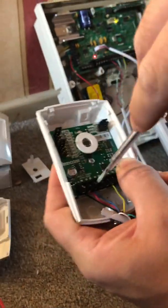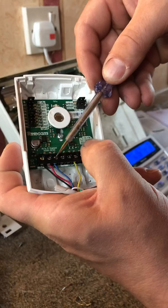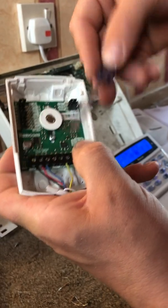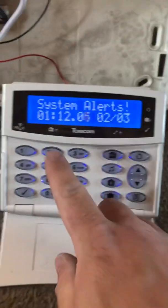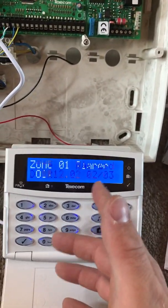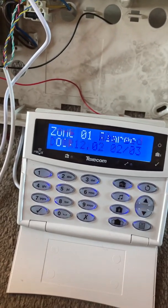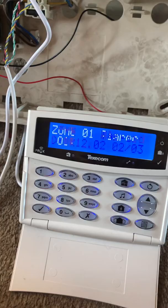If you're wiring in using these built-in resistors, you'd literally just go from the blue one into the alarm terminal and the yellow one going to the tamper terminal. As you can see, you get the same result. Thank you for watching — if you want me to go over anything, please comment below, and please like and subscribe.